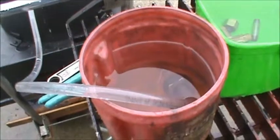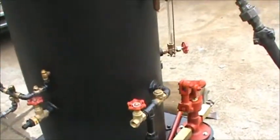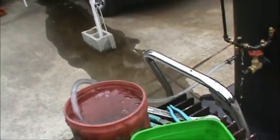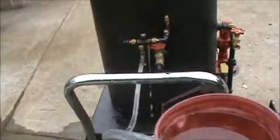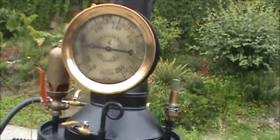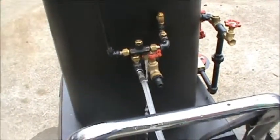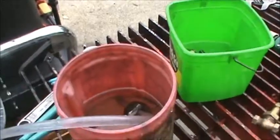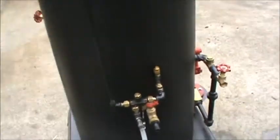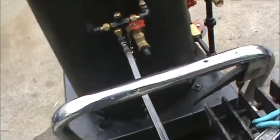All that water is going into the boiler. The sight glass over there is probably going up. I'm going to pour some more water in. You've got to have about 60 — minimum 60 pounds of pressure, which is down below 60 now, so it'd be better to be up in the 80-pound range before you run it. The lower the boiler pressure, the less water will go through it. I'm going to fill it again — I've got a lot of heat up here.